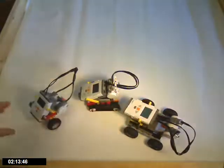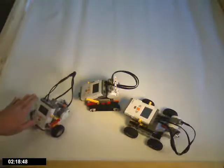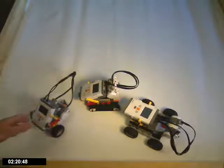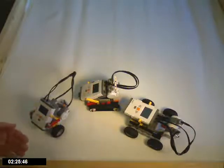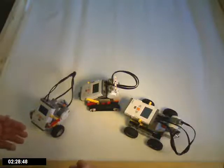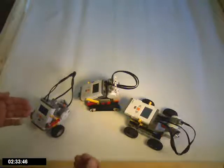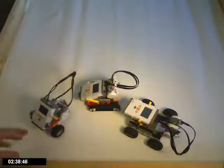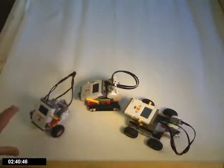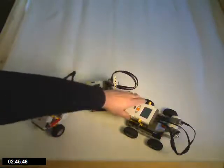So we have there the three basic types. All of these robots are steered by turning one side or the other side on. If you want it to go straight, you turn both motors on and run forward. If you want to go back, you turn them both on backwards. In order to turn, you would either turn one side on more powerfully than the other side, or turn one on forward and the other one backwards, which would cause it to spin around and rotate. So those are your three basic drive systems: two wheels with a pivot, a treaded system, or an all-wheel drive system.